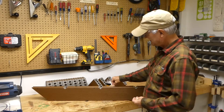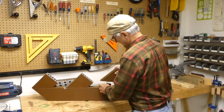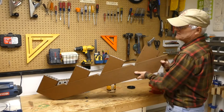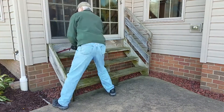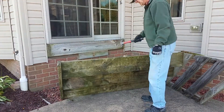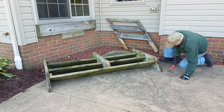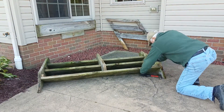In order to check my calculations and measurements, I'm going to dry fit some of the biscuits and the wedges and the stringers and see if that assembly comes together here in the shop before I take everything outside. At long last, demo day has arrived. I've got enough pieces now to begin my stairway build and I need access to the side of the house, so I'll use a crowbar and detach the stairs and the railing from the house and set them aside to be further deconstructed at a later point.